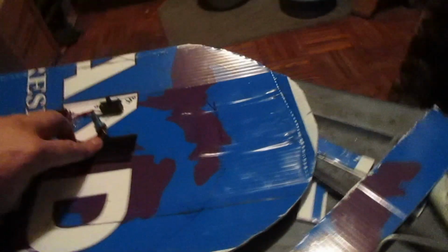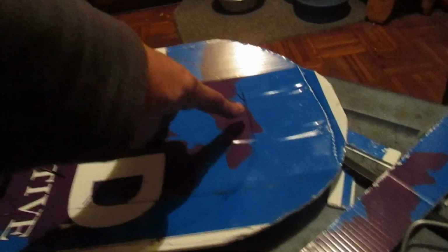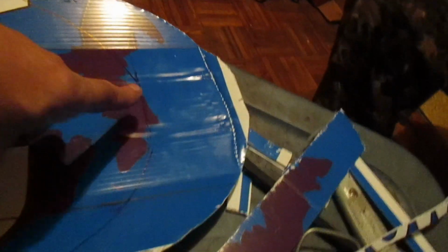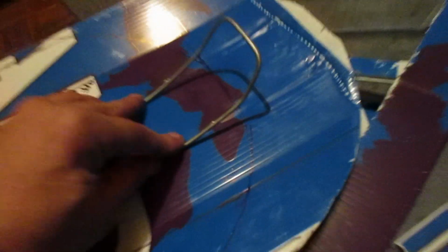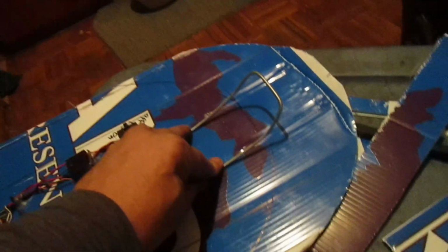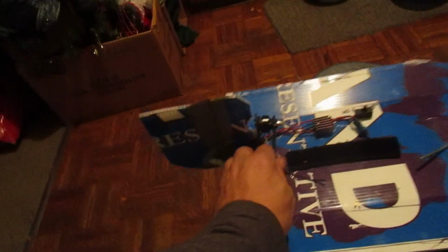And we are going to get rid of the tip in the front because we were getting air underneath it. So when we move the chop, I don't know if you can see it, the line right there. We're not going to necessarily bend the plastic. We're going to use this piece of metal in the front to kind of make a bumper that'll just lift the front up if it hits something, but keep the plastic relatively flat so it doesn't get that air underneath it, because that's what flipped it up and busted the motor.